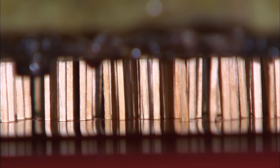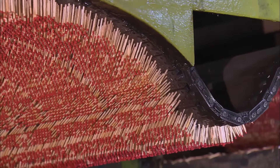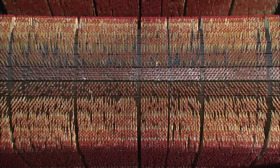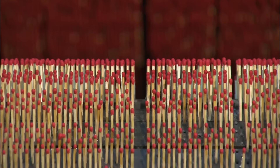After 5 seconds, the match bar moves back up and the head compound mixture flows down into the mixing pan, to be renewed before another section of the match bar moves in. After dipping, the splints keep rolling down the match bar chain for drying. The chain loops up and down for an hour, leaving the match head compound time to dry thoroughly.